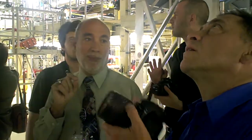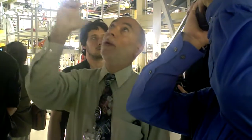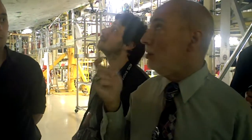What we do is we have to waterproof the tiles. There's a specific gun that has a needle that, when applied in that little hole, penetrates the hole and sprays a material we call DMES. It's like a Scotchgard, a waterproofing. They use infrared guns after the vehicle lands to see if we have any moisture areas that need to be addressed.